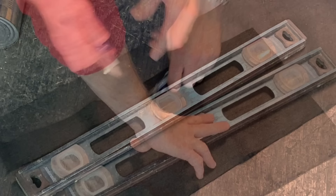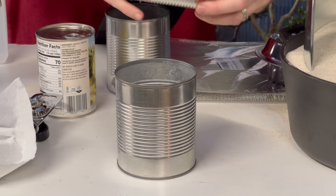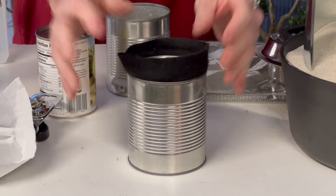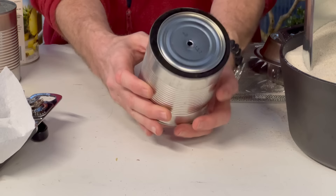I'm going to carefully cut this so we have two good layers of carbon felt. This is our outer can, this is our inner can — they're going to fit together like that. I'm going to wrap the inner can two times with the carbon felt, make sure it's good and tight, and this is going to be our forever wick. It's going to be a tight fit so you may have to force it in there. After doing this a couple of times I realized you can twist it as you insert the can — just twist it slowly and it'll go in a lot easier. You can see it's just at a perfect height, right at the rim of the outer can.